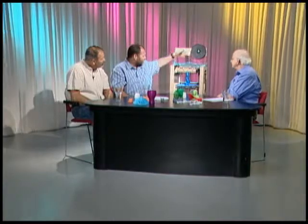I mean, this is PLA here. As you can see, this bed is not heated, and with PLA you don't have to have a heated bed. It's very comfortable as far as shrinkage of the material during the printing process.